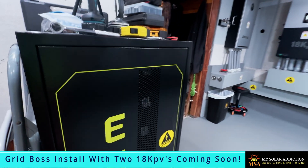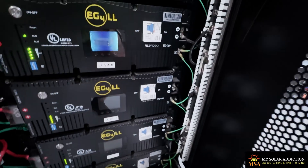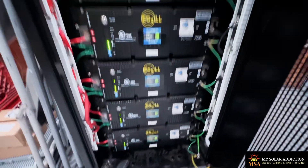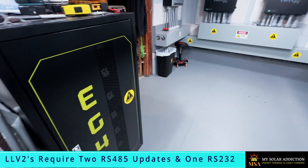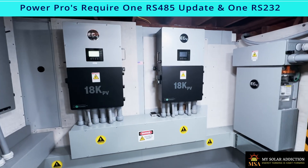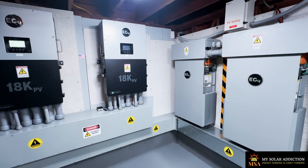Today we're going to show you that my six LLV2s are working just fine with those PowerPro all-weather wall batteries — there seem to be some folks having trouble with that or wondering if they work. They definitely do work, and they're communicating right now. I'll show you on the monitoring app all the battery information that shows up once you do a firmware update. You need to do firmware updates on all your rack batteries as well as your PowerPros to make sure they're communicating. We'll show you how to do the firmware updates, verify they were done properly using BMS tools, and show how they're working together.